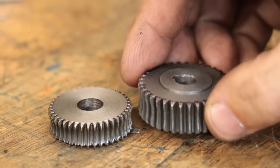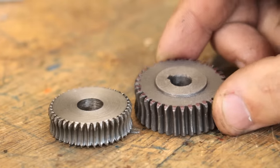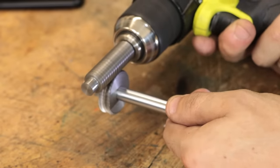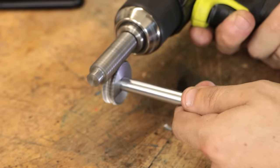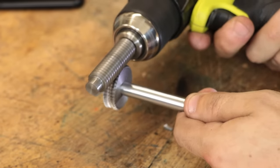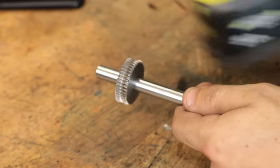And visually, it's not too different from the lathe's one, although the worm screw is definitely larger, diameter-wise, on the lathe. And you can definitely see that difference in diameter on each gear. And thankfully, the worm works really great under load too. And the action between the gear and the worm screw is definitely a lot smoother now that it has its new helical profile. However, because we started with a fully formed gear and then we cut into it, the resulting worm gear is actually cut undersized.